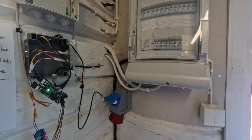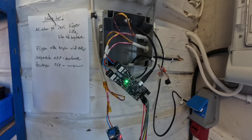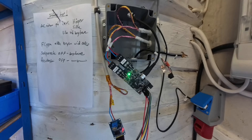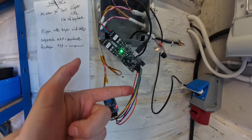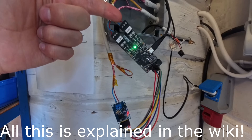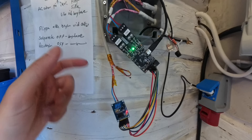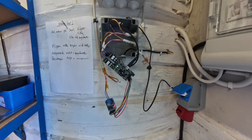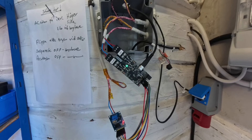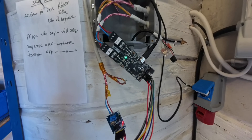I'll also show you what's possible right now today. Let's look at my setup — this LilyGo, the one you're very familiar with if you've seen the battery emulator. I've used the GPIO pins to add on a second CAN channel. The first battery plugs in here and the second battery plugs in here. Unfortunately you can't have them on the same CAN channel because then the CAN IDs would collide and it would be impossible to tell them apart. So two CAN channels are required for this.